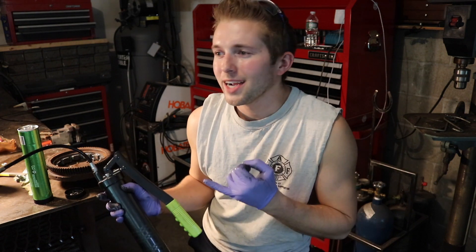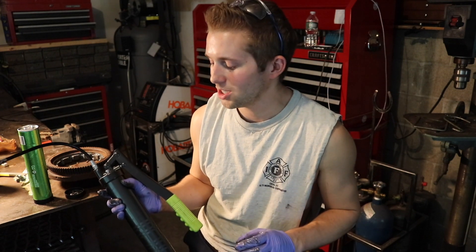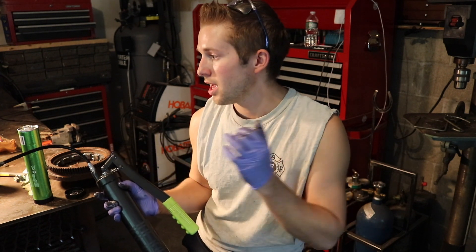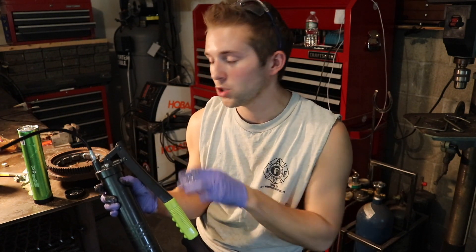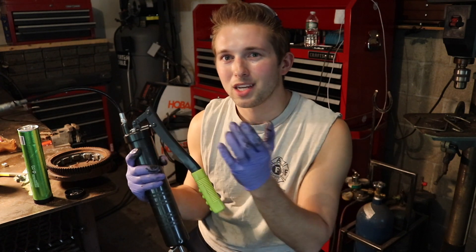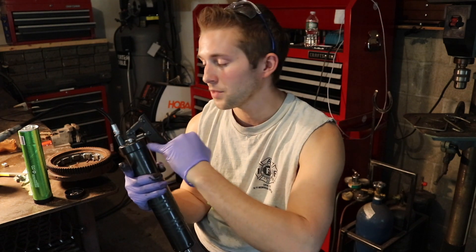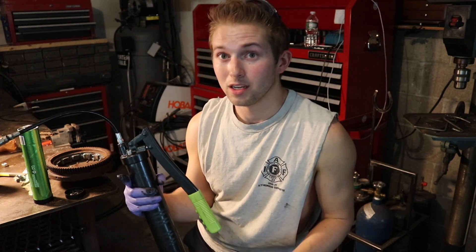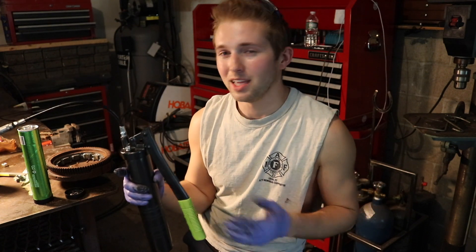With tackier grease like number two — or number three if it comes in a tube — those are going to be harder to prime. The warmer the environment you have the grease gun in, the easier it's going to be to prime the pump. Try to get as much air out as you can — there's either going to be a bleeder on top or you can just crack the handle open a bit. Just make sure no grease is pouring out; if grease comes out where the pump threads onto the housing, you know all the air is primed out. Worst case, leave it upright in a warm environment and pump it from time to time over the next day — that normally works.